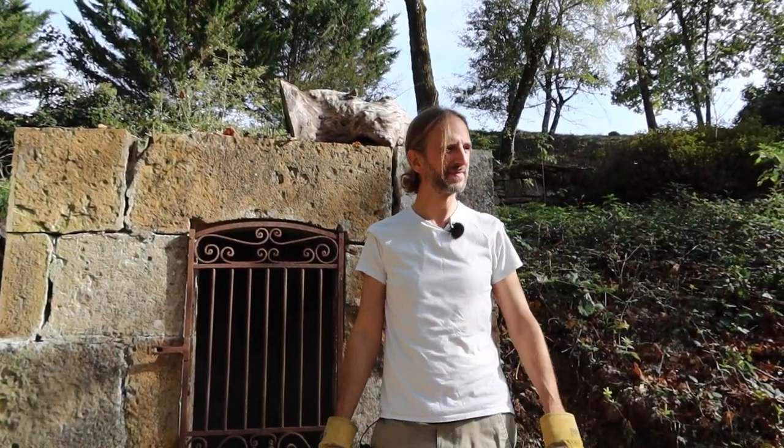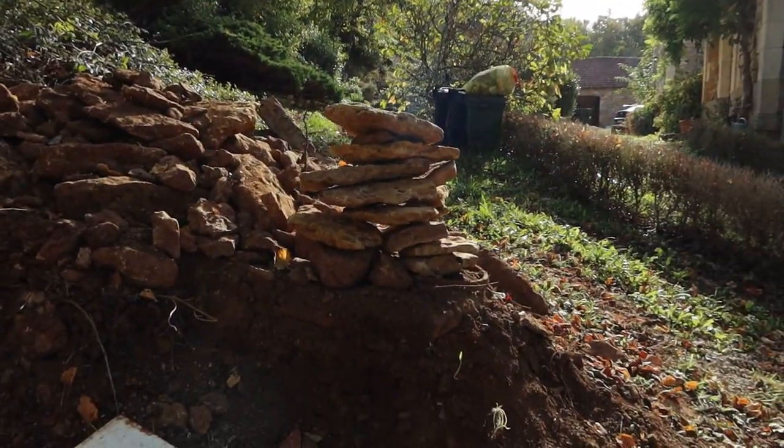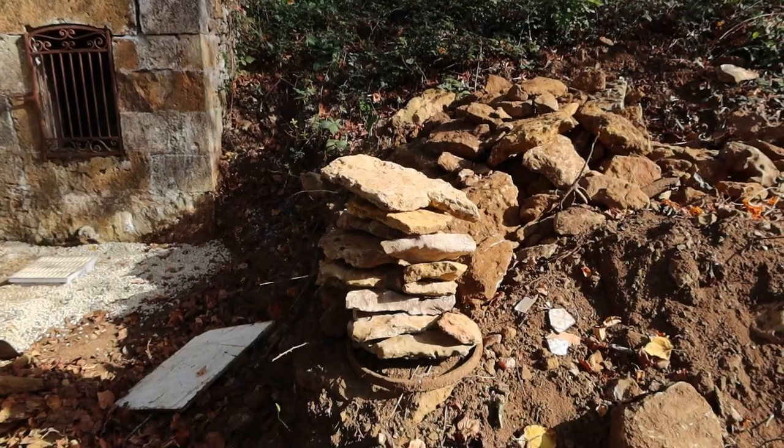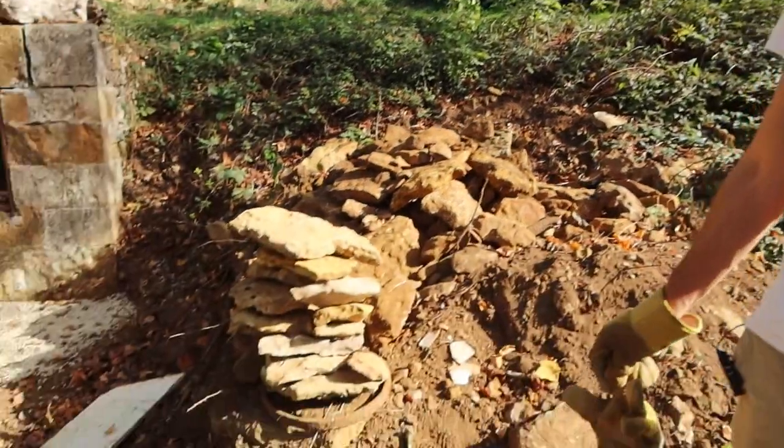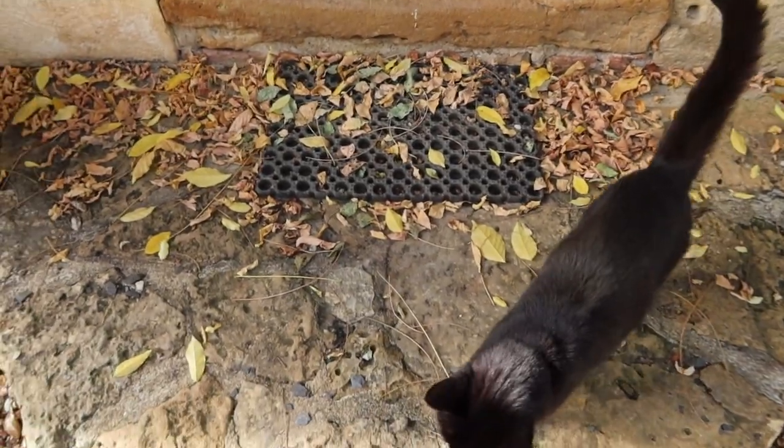I've been cleaning my rocks - yeah, these rocks. That little sort of can that you've made over here. You really have washed and cleaned them, brushed them off, because mortar doesn't generally like to stick to mud, so you've got to get the mud off the rocks before mortaring them in place, otherwise they won't stay there.